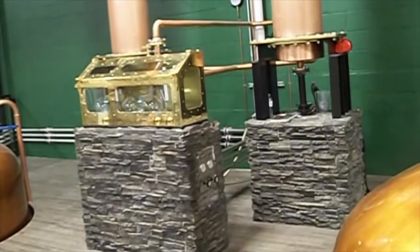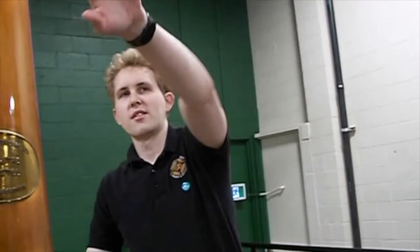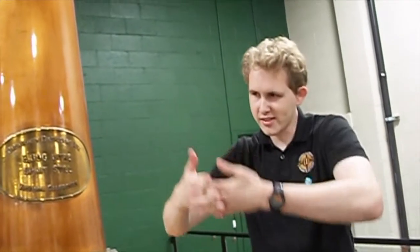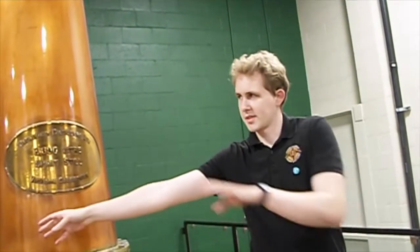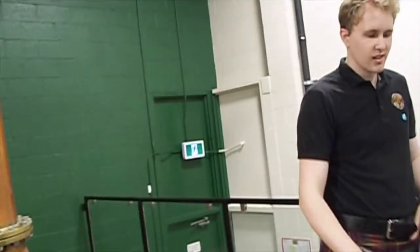They have the same proportions, but as you can see, there's no window on the side. There's no porthole. What's your guess of why that exists? Exactly. For beer, of course, we take off the yeast and then bottle it. But for whiskey, we don't touch the yeast. We just pump all of that liquid, that whiskey wash, into the tank. Yeast is something that loves heat, so if you add more heat, it might get a little too active and bubble up the column. That's so that Mike can see if it's coming up the neck, and then turn down the temperature. But at this stage we're dealing with spirit, so we don't really have to see what's going on inside.